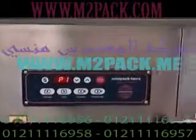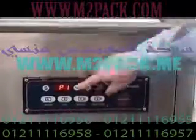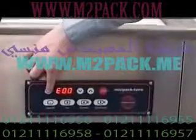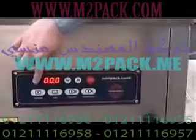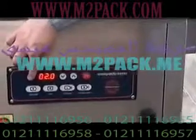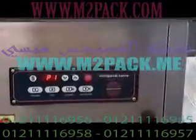I'm going to turn this all the way back to full air return. I'm going to be using the program 1, 99.9% of the air taken out. I'm not going to extend that. I'm not going to use any gas because I don't have a gas line hooked up. I'm going to have the sealing arm seal that bag for 2 seconds. And now we're back and ready to start.